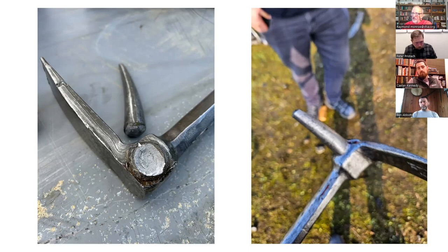That's great information. I didn't recognize this is a welded-on structure, and that's always going to be difficult with these particular materials. When we work with DOD people, as soon as you start getting alloyed steels run up to relatively high hardness, it's difficult to get a weld that doesn't inherently have some lack of toughness. And one of the distinctions not easy for non-metallurgical people to get their head around — there's a difference between ductility and toughness.